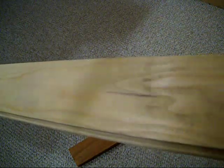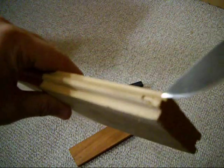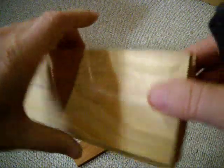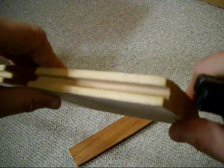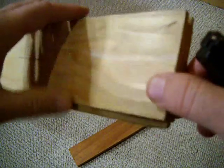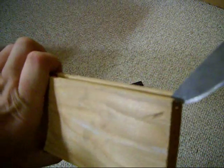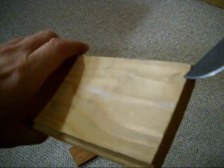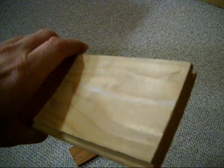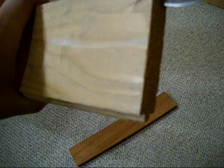I'm going to mark this thing. This is a floorboard, so the tongue and groove part is waste. I paid just over three bucks for this board. I'm going to rip off the excess on the bandsaw, cutting just a hair under three-eighths of an inch — just a long rectangle. I'll have something three-quarter by three-eighths, roughly. Then I'll take that three-quarter and split it in half, giving me two three-eighths squares.